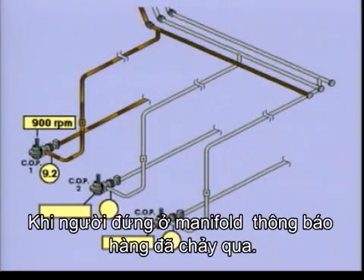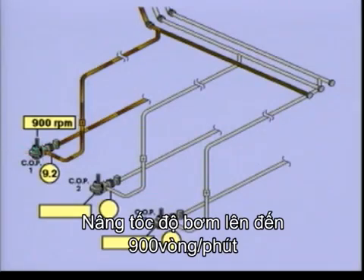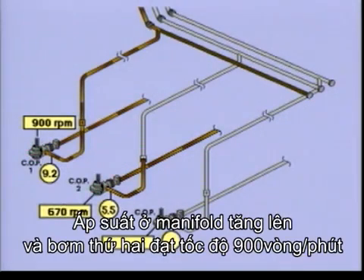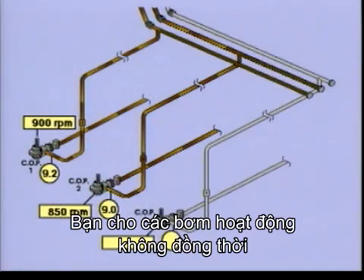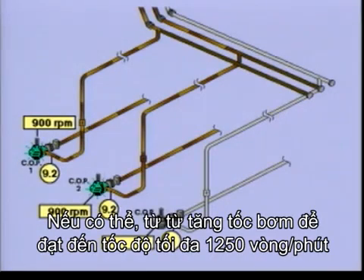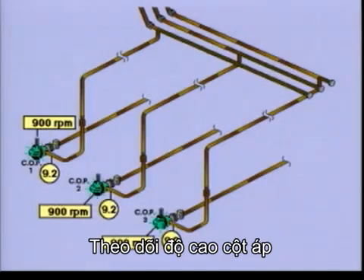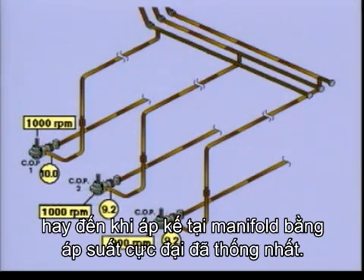The man at the manifold has reported a flow of cargo. By now, the discharge valve is fully open. Take the pump up to 900 revolutions, then start the next cargo pump in the same manner. The pressure at the manifold increases as the second pump is taken up to 900 revolutions. Start the third cargo pump in the same manner. You are phasing in the pumps to run in parallel. Take your time doing this — it takes at least half an hour to bring the pumps up to maximum capacity. The pumps are gradually taken up, if possible, to reach their full speed of 1,250 revolutions. Watch the head and increase the speed until the pumps reach maximum capacity, or until the manometer at the manifold shows the agreed maximum allowed pressure.